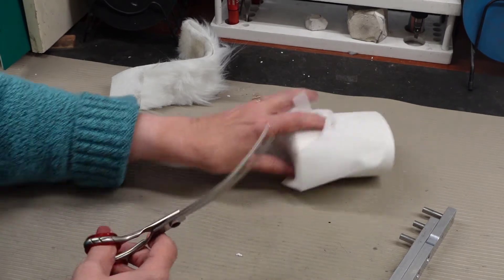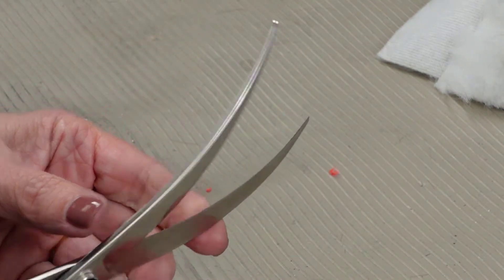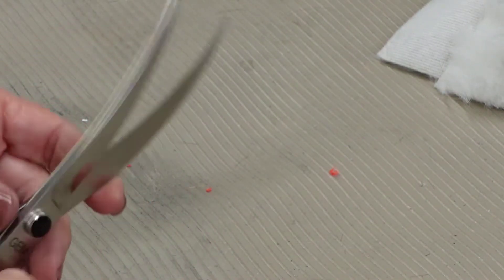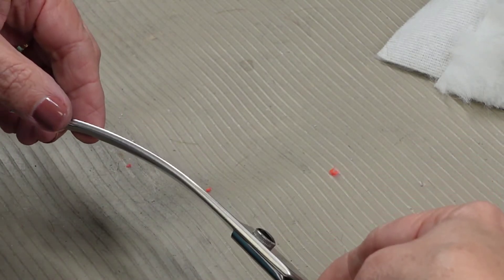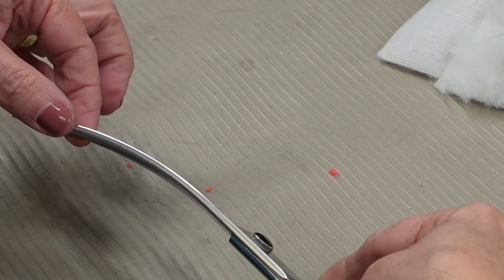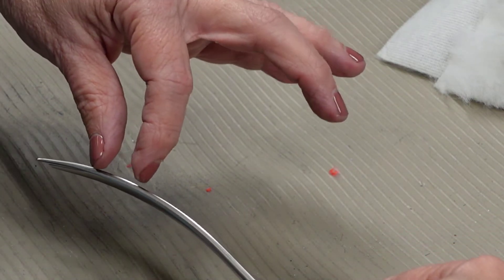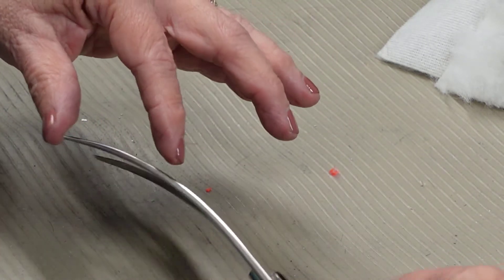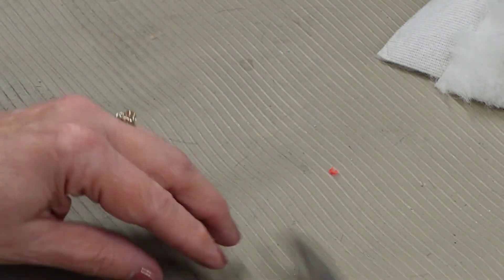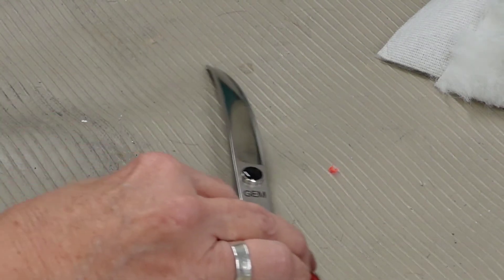This is why you need hands-on training. If I close this and hold it to the light, I would see the blades touching in one spot all the way down, and then when it gets to the end it's going to be like a wider spot that's touching — and this is where the problem area is. So I'm going to try bending it.